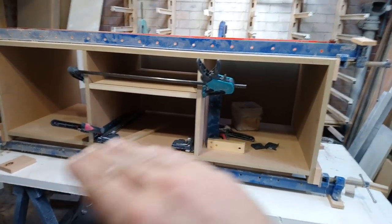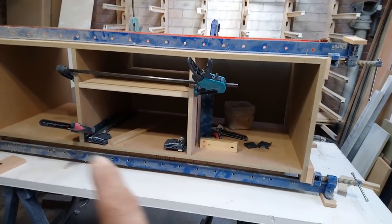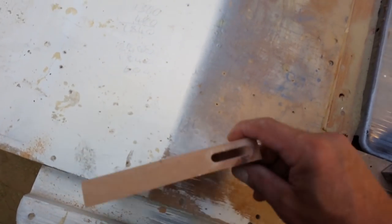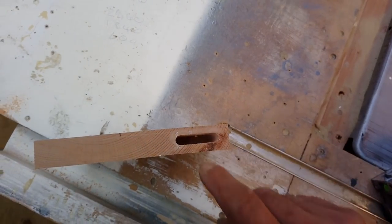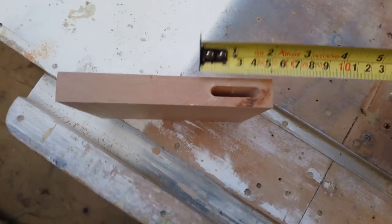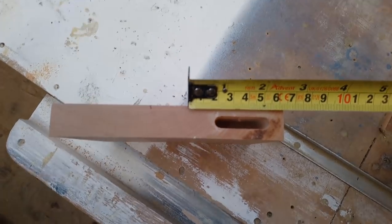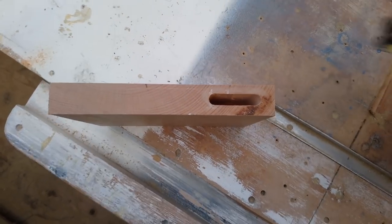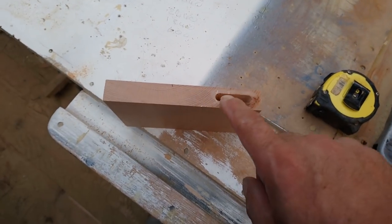that when it goes to the job, whether it's going to sit to the shape of the floor. I am going to put another frame underneath, but whether it'll sit to the shape of the floor, I don't know. So I just did a little test cut on a scrap piece using just the first stop against the edge and then move it so that the stop's sitting inside this edge here. And that gives you a mortise about that big. And then I reckon 10mm for the groove. I should be able to comfortably get a 70mm with a half decent sized tenon. These are only little doors, so I'll make some tenons for there.